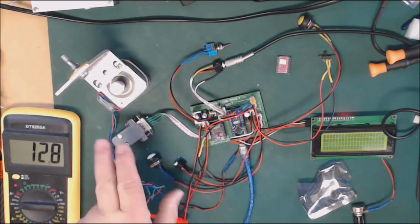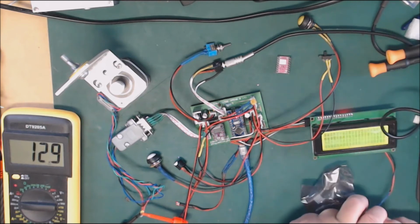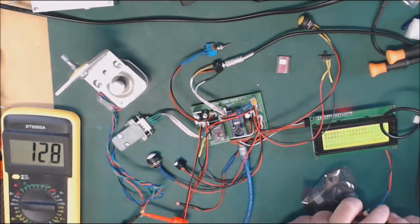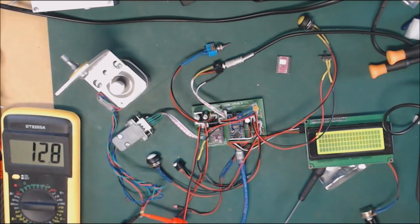Alright, so look, I'm satisfied about where it is. I can't hear any hissing noises or anything. The current does vary all over the place, depending upon what stepping mode you are in. I need this to be at half steps, so I've set it back to half steps. And it's telling me here that it's position 500. Power's on. It's on half steps. So let's tell it to go to like 3600. Go to. That's at full steps.